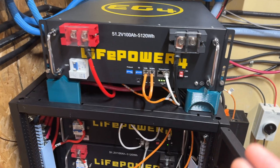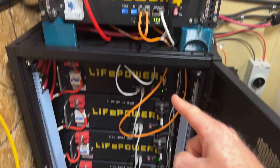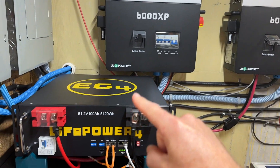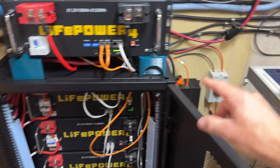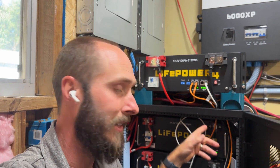So how was it working? I got overzealous and installed this battery when it was at 100% and the others were not. Since this is the master battery, these charged it up to 100, but the others only went to about 50 and I had some issues there. I ended up using the charge inverter to individually charge each one up to 56 volts, and from there it ended up balancing itself out and they've been great. The SoC lights have been the same. It was really weird — it took about three or four days for the monitoring software to accurately show the correct number of batteries.